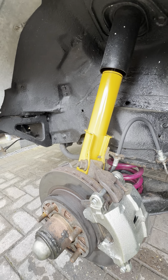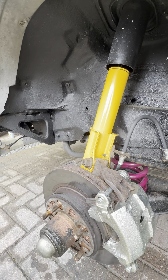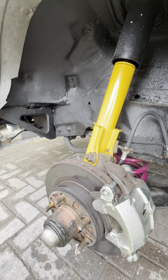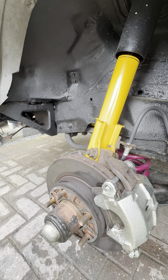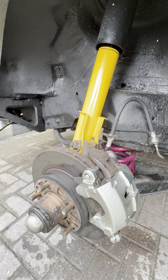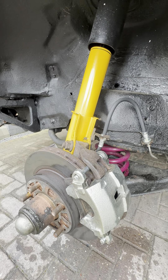When we were driving it, the car was pulling sharply to the right, which indicated that the front right-hand brake was working but the left-hand brake wasn't. However, as we came to a stop we could smell brake burning, got out, checked the wheel, and it was very very hot compared to the offside wheel — so we knew we had a binding brake.